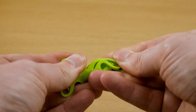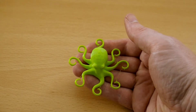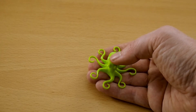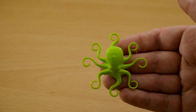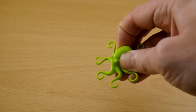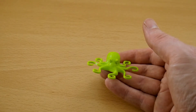These are brilliant — I love flex filament, it's my new favorite. I was relatively happy with the quality I was getting, left it overnight, came back the next morning and figured I'd give it one more try. My last print — admittedly a slightly smaller model — was printed at 30 millimeters per second, nozzle at 200°C, bed at 50°C, with half a millimeter retraction at 30 millimeters per second retraction speed. As you can see, there is hardly any stringing and hardly any blobs on the arms whatsoever. I think these are the settings I'll be using going forward. It has 10% infill which is why it's a little bit harder to squish — but there we are. In conclusion, yes, you can print flexible filament on a CTC 3D printer.